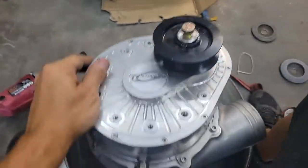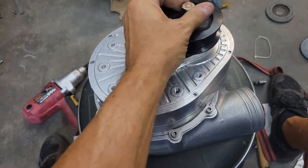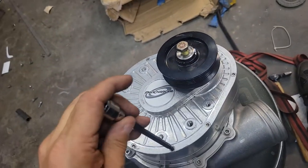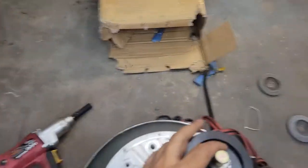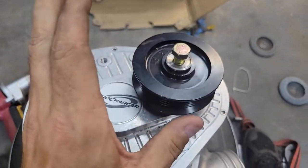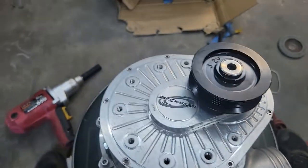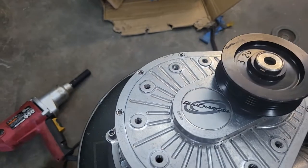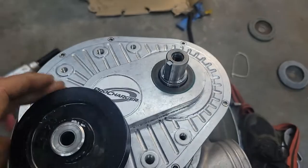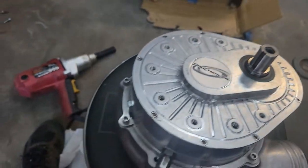The first thing you're going to do is take this pulley off. I've already broken it free. Depending on how yours is - you can see mine is snugged down because this is a brand new ProCharger, never been run. It's five-eighths. You may have a little dust boot that goes on there - a lot of guys throw that away. Take this off carefully because there is a keyway in here, so make sure you keep that with your pulley so you don't lose it.